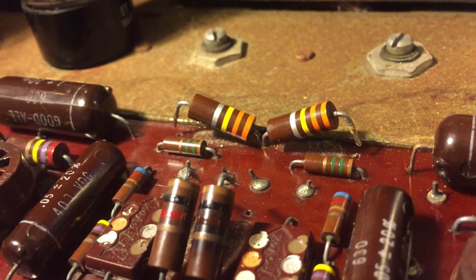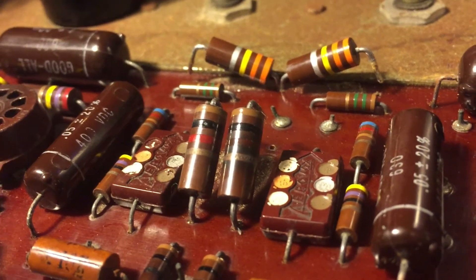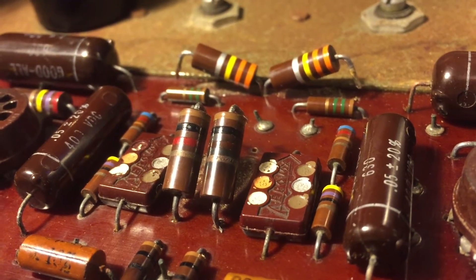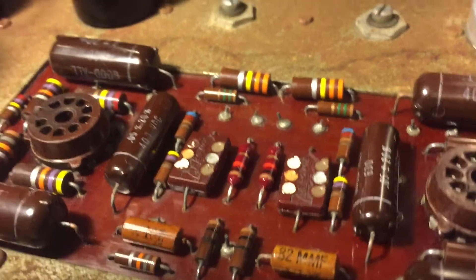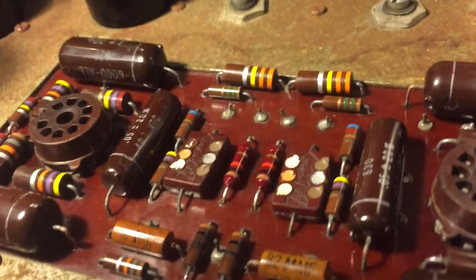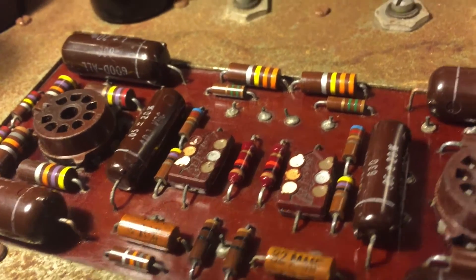The back ones both tested good. The 1K on the left was 1.1, but the 1K on the right was 1.6 — as I suspected, there was probably something wrong with it anyway, so both are going to be replaced. I went and reseated the resistors in the back and replaced these two resistors. This is from my collection of European parts so it looks a little different. I'll probably get the right resistor at a higher wattage, but this will do for now for the purposes of testing.